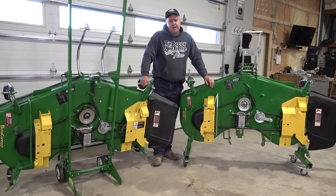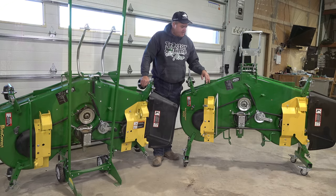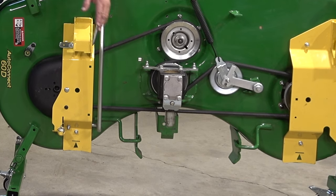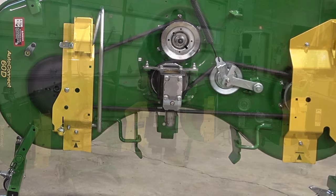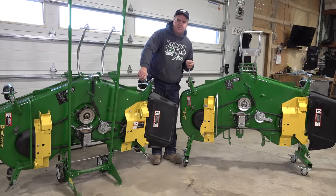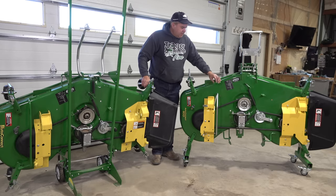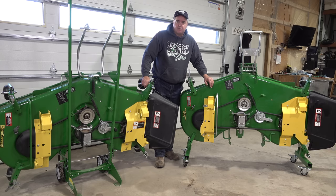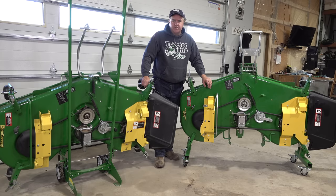One question people often ask when storing a deck vertically is about the oil leaking out of the gearbox. There is a little vent hole here that can sometimes get plugged up over time, plugged up in a strange way such that it stays open and allows the oil to come out. So if you do store it on end, make a little provision to put something under there, maybe towels or a cardboard box or something. And when you take it back down next spring, check the oil in the gearbox to make sure it's got enough oil in it.